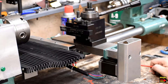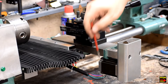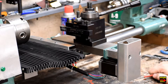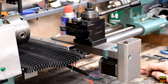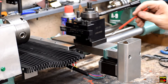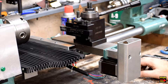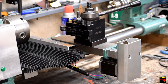The other major thing we did was install limit switches. What limit switches allow you to do is, first, prevent the lathe from crashing — the motor will interfere with the carriage on one side. I sized this to try and get 100% full travel but I'm off by about an eighth of an inch, so if you run it all the way in, the back of the motor crashes against the carriage. I've got a switch in there now that trips before it reaches that point. On the outboard side I have a limit switch to reference zero — so when I start the machine up, it references out and the machine knows where zero is, which matters because that changes the offset for the tools.